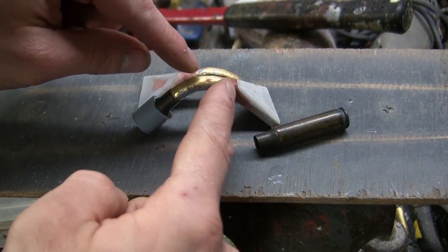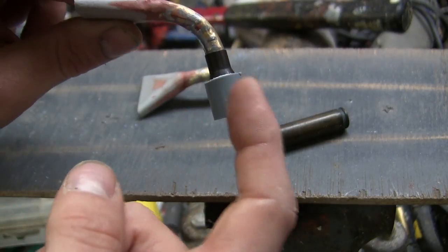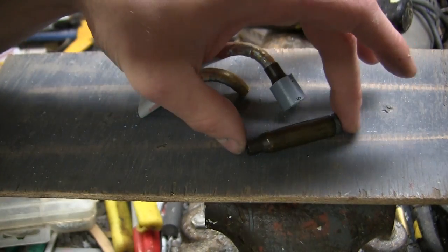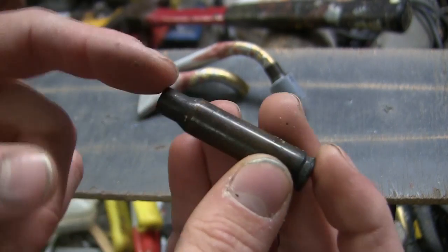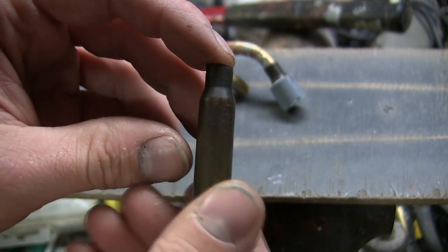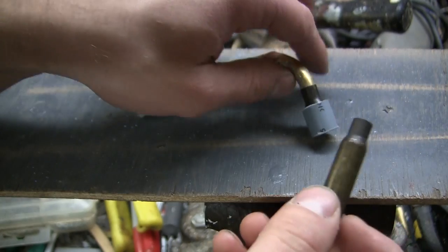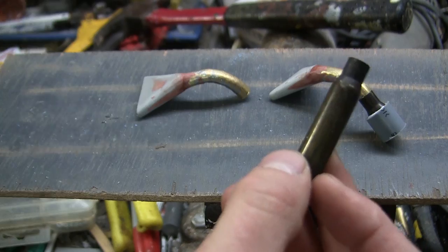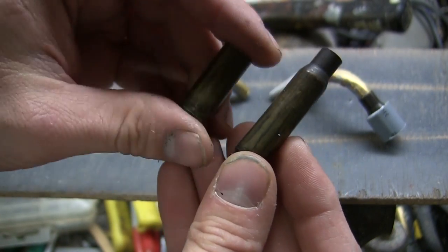To adapt the funnel to mount onto the Armortech supply PVC ring, I had to make a small adapter. The adapter, just like on the other build, was made from a recycled bullet shell casing. For this vehicle I'm using a scrap .308 caliber shell. The .308 is nice because it has a taper to it, which wedges in firmly into the PVC. This one has already been cut off and the same procedure will be done to the other shell casing.